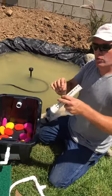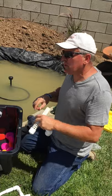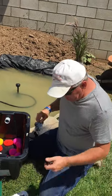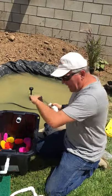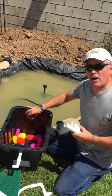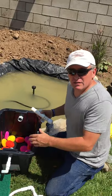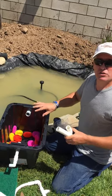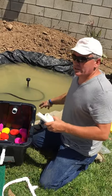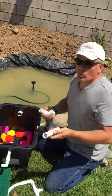You get your pump — it has two options usually with any of your pond pumps: one for a filter, one for your little fountain. What I did is half-inch going in from the pump, and then you want to double your size going out. So if you have a big pond and you want one inch going in, you need two inches going out, because the return back into the pond is gravity-fed.